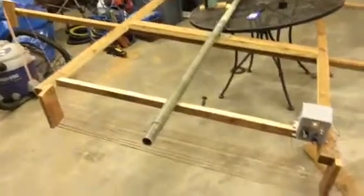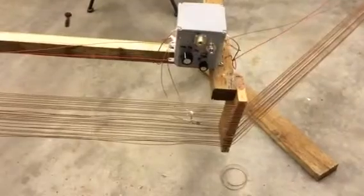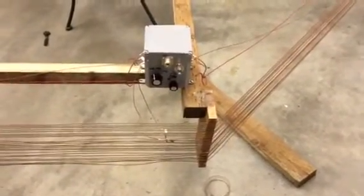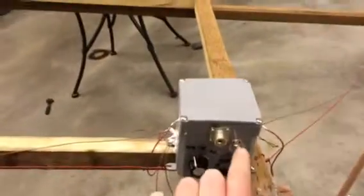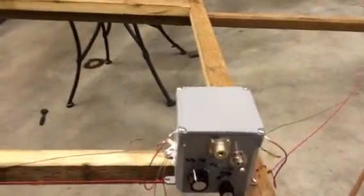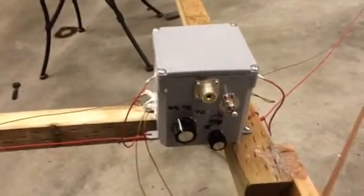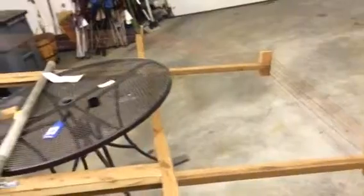This one's got about 25 turns of 20 gauge wire in the loop. And you're looking at the matching box there. From that we can switch in additional amounts of capacitance. At the moment it switches in an additional thousand picofarad across the red wire you can see there, which is the coupling loop that goes around about six inches inside the perimeter of the main tuning loop.